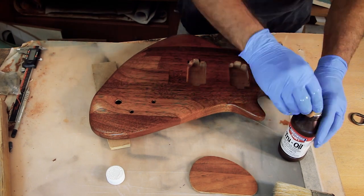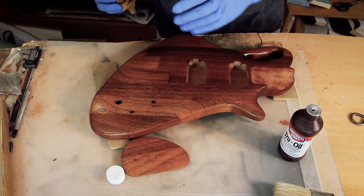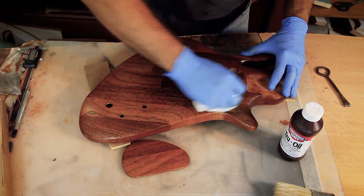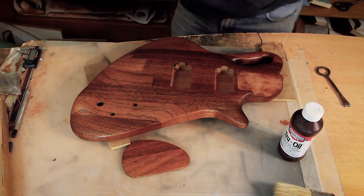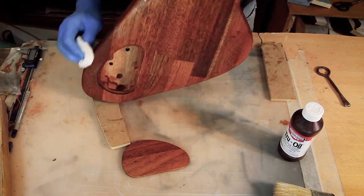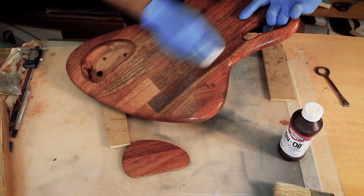When it starts to build up you can also rub it wet or dry with either very high grit paper, or as I prefer, the spongy 1200 to 1500 variety. Another option is to scuff it or smooth it with a fine steel wool — this can also work for the final layer if it's too glossy.